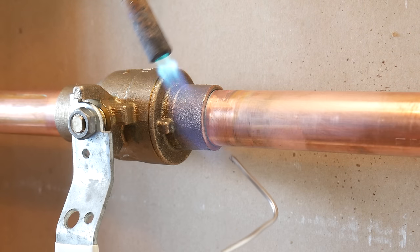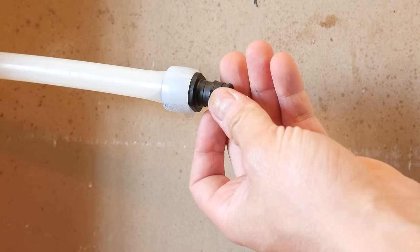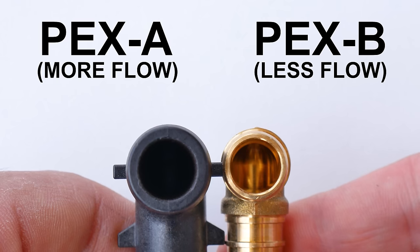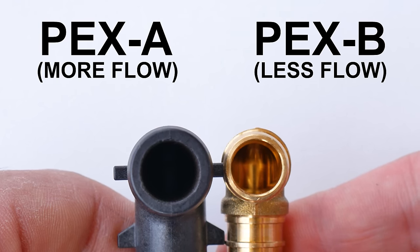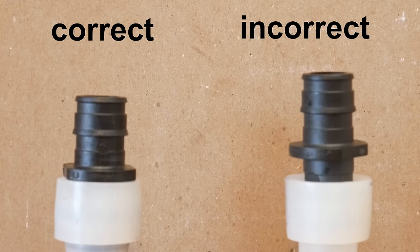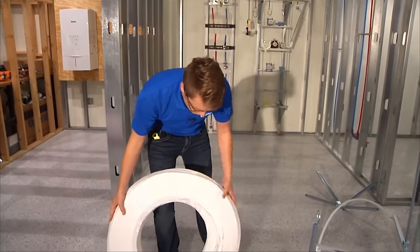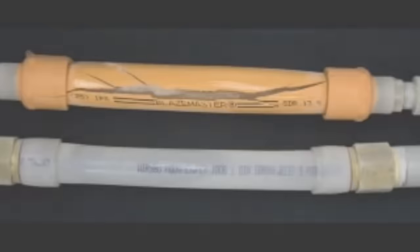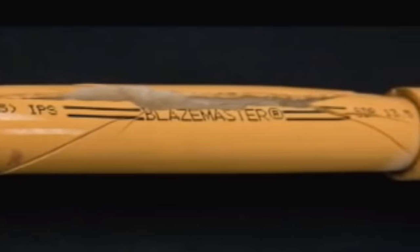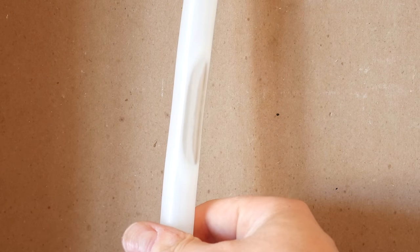On to the pros and cons. For the pros: this system doesn't use flames or chemicals like when soldering copper; you could install it wet, which can't be done when soldering; and it doesn't require as many connections as PEX B, as it's really easy to bend. PEX A fittings have better flow than PEX B fittings as they have a larger bore. Another nice feature is that they can't be dry fitted like copper or PEX — if they aren't completely on, you'll have a good visual indication, which is something you don't get with copper or PEX. PEX is lightweight, doesn't corrode like copper, and has better freeze resistance. Before it splits, it'll expand much like with the connections. And if you kinked your pipe, you could always heat it up to get it back to its original shape — PEX B and PEX C do not have this feature.